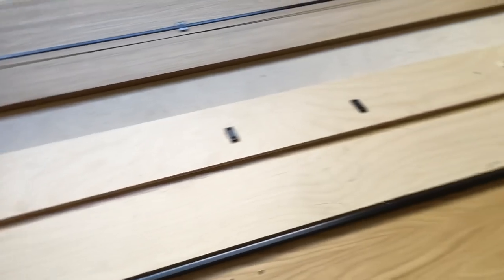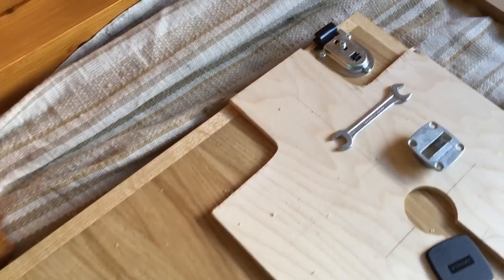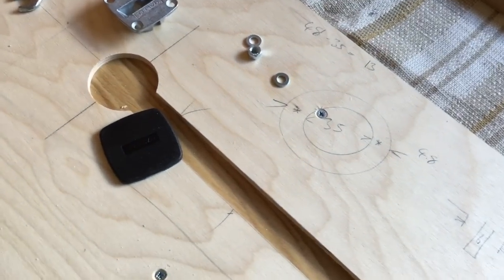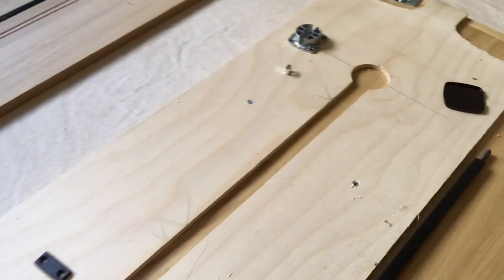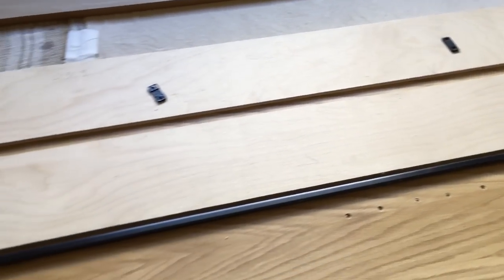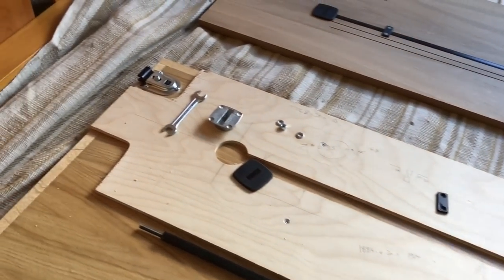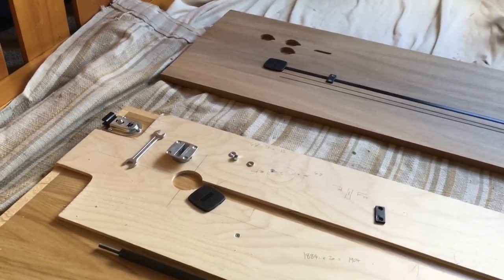We made the jig the height of the doors in the workshop. Since bringing it to site I've cut out the corners so I don't have to remove the sliding door hardware. I've also pre-drilled and countersunk four holes for 17 millimetre screws — four should be enough to hold it in place. This all needs to be done quickly because we've got six doors, meaning 12 of these to fit, and it's costing me money since I'm putting right a bow that shouldn't have happened.